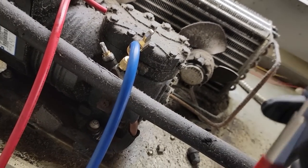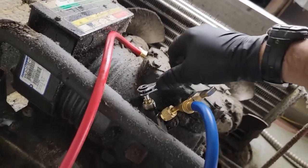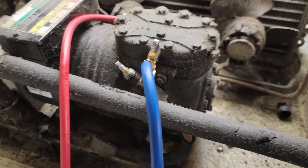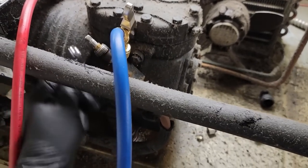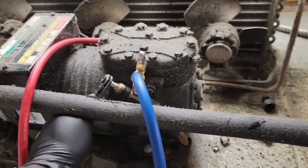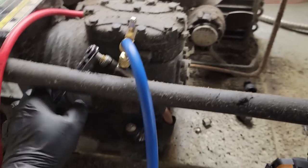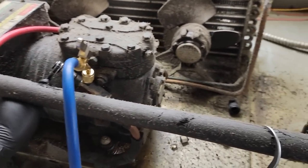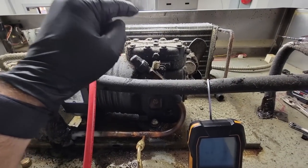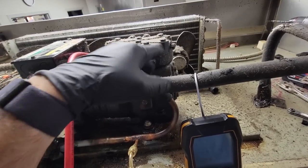I think that makes a difference — but that's going to snap; guarantee it. Then you have to drill it and put a tap on it. I got on there with vice grips and vice grips did not work — clawed the heck out of it. Went ahead and loosened the packing nut. That metal shaft is frozen to the other piece of metal down there.